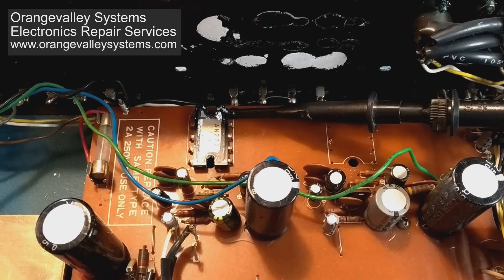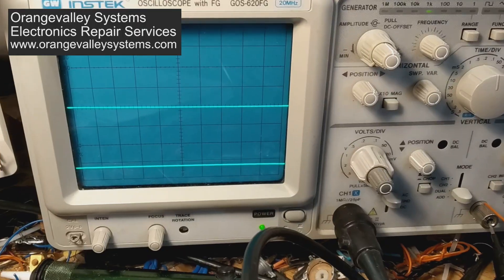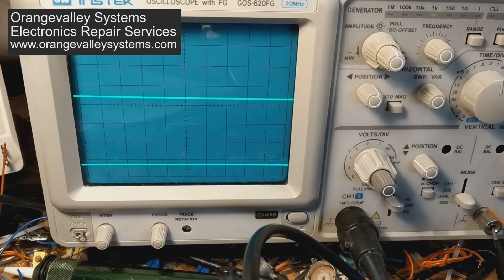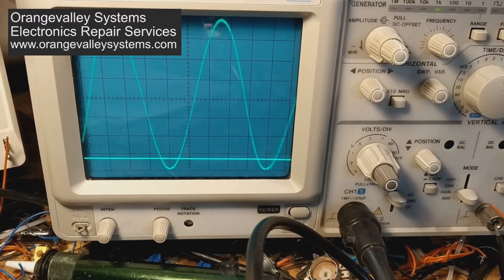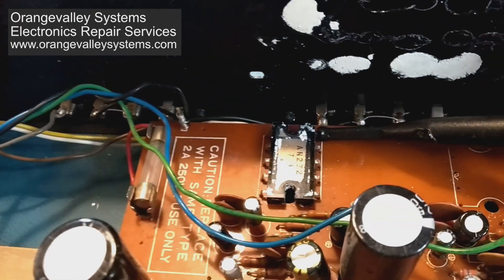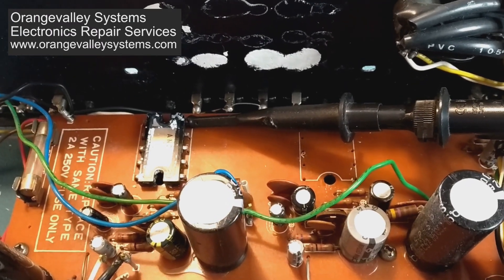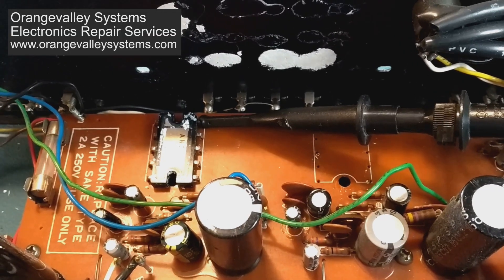So this is now the good chip in the position where the bad chip was. I'll switch it on — the output loops around a bit — but if I turn the volume up we've now got an output. So that confirms the chip really was faulty, and they are completely obsolete. There's a problem, but there is a solution and a plan.